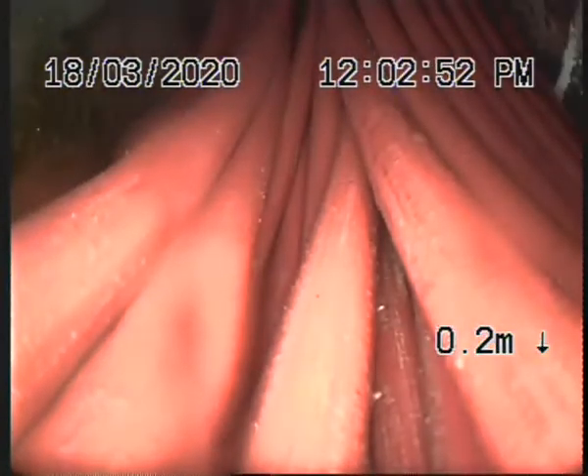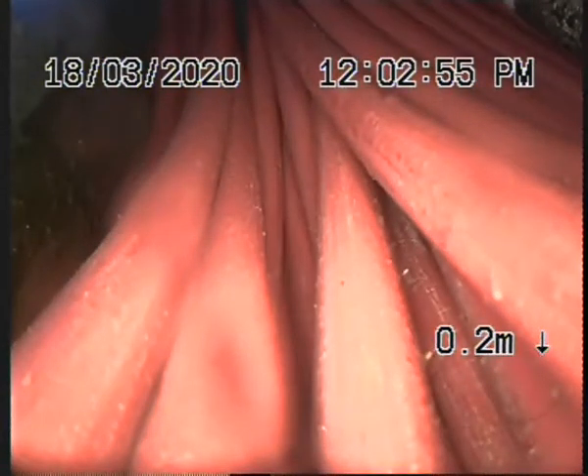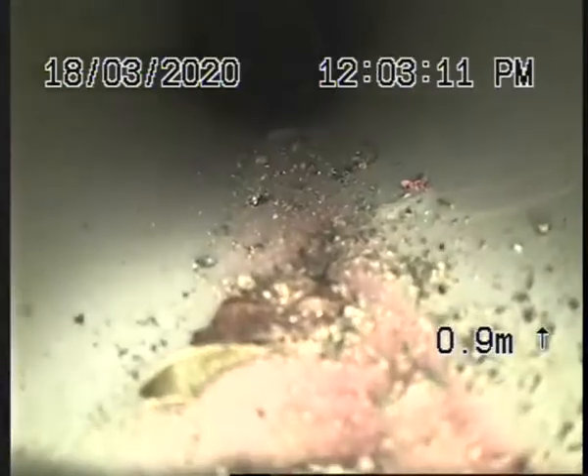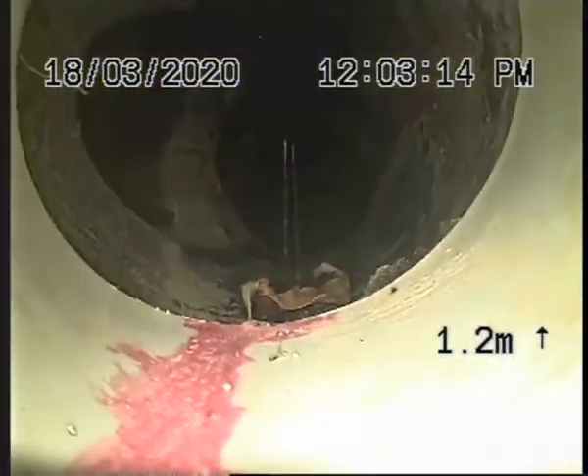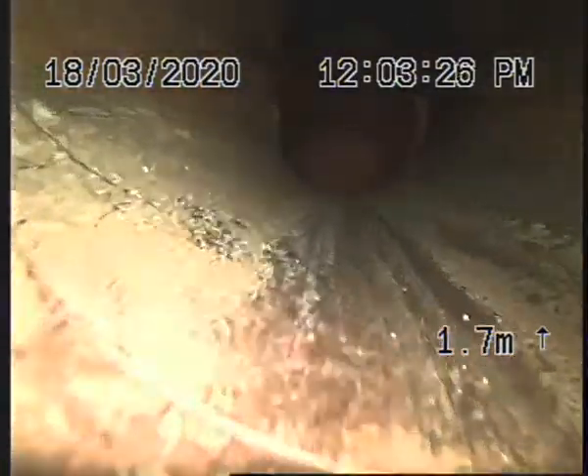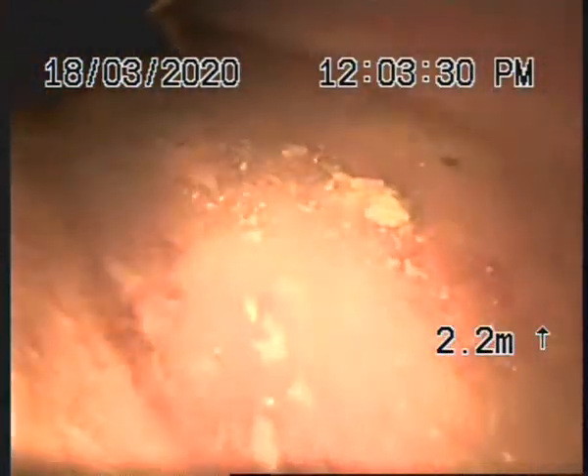The only stormwater available to me is a PVC downpipe, looking at the path from the road on the back left. There's the downpipe there. There's the road up there, up the driveway. The stormwater main should be really close. There we go — we've got a branch coming in from the left there. You can see the existing earthenware which is nice and cracked up. You can see all the damage there on the bottom cracks.